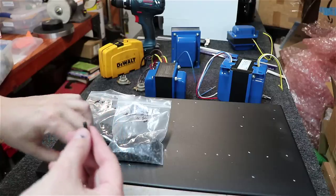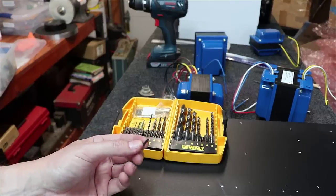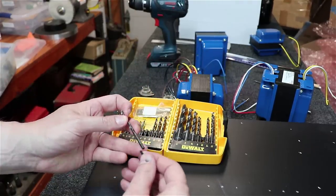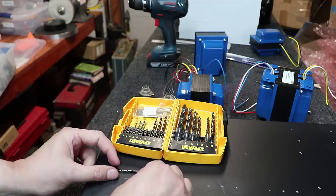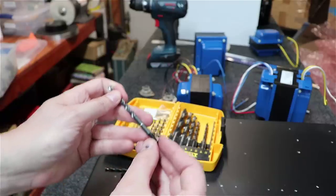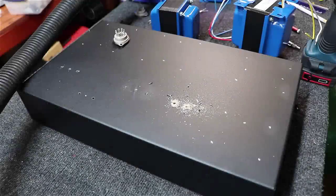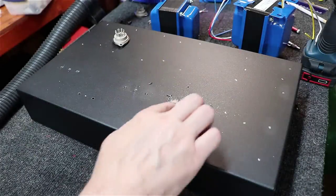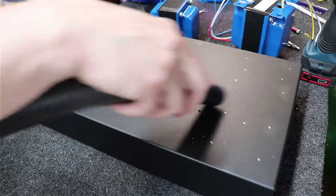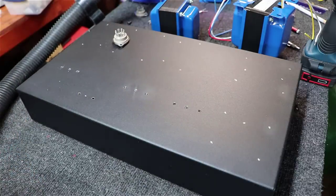And then you just find the right size drill bit to match up with these. As you can see here for this little one, I'm finding a 9/64 inch bit, and I hold the screw up to the bottom of it and see that that's just about right. And then I think it's a 13/64 bit that this matches up perfectly with. So that'll get us what we need. As you can see here, continuing to just drill along, when you get through to the wood, a good bit of wood will show up on the other side. And just keep drilling and vacuuming and moving along.